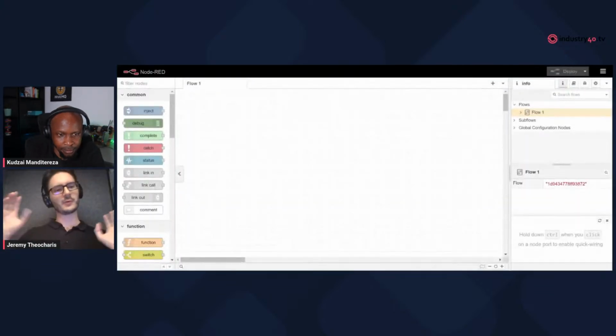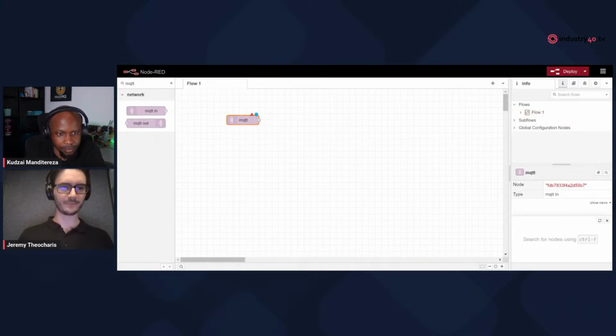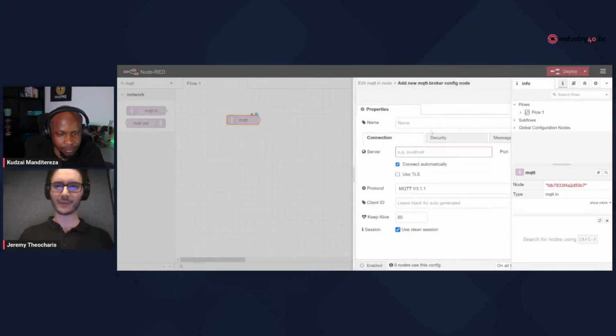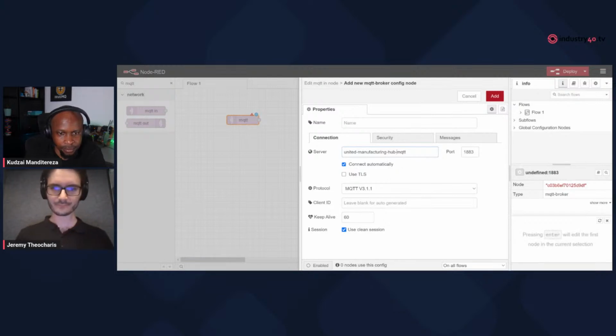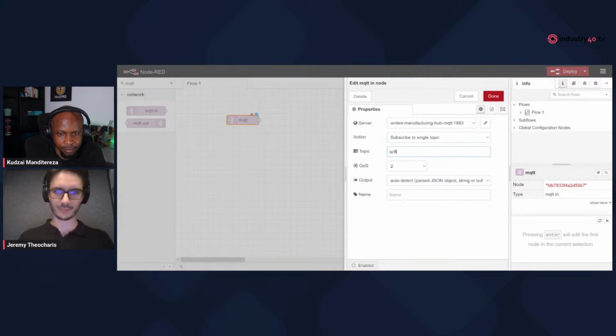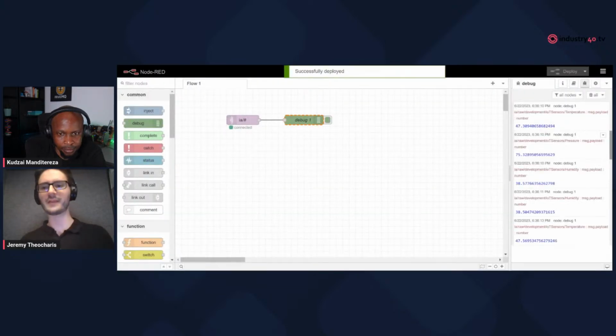So as you remember, there's Node-RED, and it's the connectivity layer. There's a unified namespace, and in this case, there's already simulated data coming into the MQTT broker. We can see it in Node-RED by selecting MQTT in and adding the new broker. You can also find it in the management console. There's a link here. It's hard to remember: it's united-manufacturing-hub-mqtt. Let's subscribe to everything, and I'm adding a debug node, and we will see the data that's coming in.